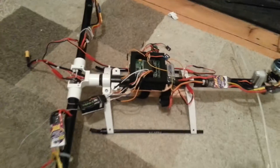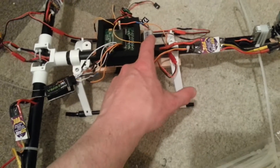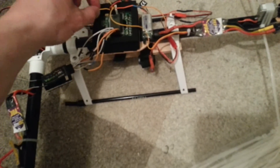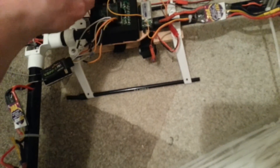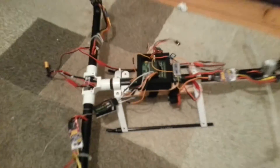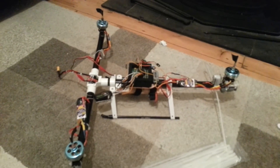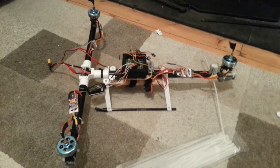I will let you know. You can wire it that way — you don't have to wire it the way they say. You can wire it off a separate BEC, a U-bec. But make sure that those signal wires are the only thing going to the board on those channels. That should also help with not having two or three BECs on the board at once. Good luck all, see you later. Cheers, bye.